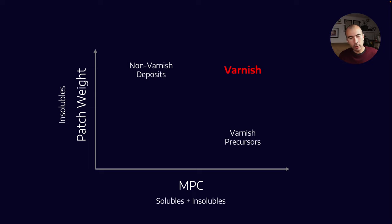Now technically, when we talk about whether I have varnish, that means whether I have varnish in the equipment system. You can't really tell that from an oil test alone, because theoretically maybe all the insolubles are just circulating around the system and haven't stuck to any equipment walls. But if you have insoluble particles that are varnish particles, there is a very good chance they are either about to stick to equipment or they already have.